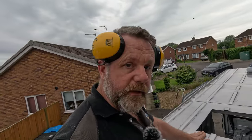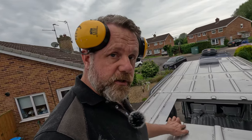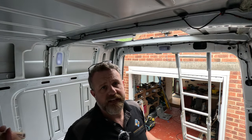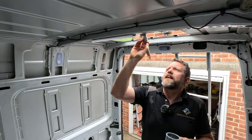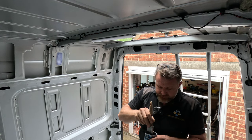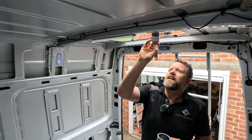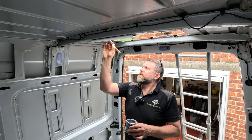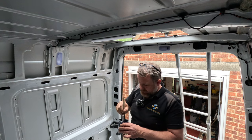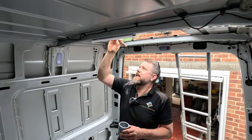Now I've got to do the painstaking job of filing it, quickly get some paint on it, then clean it up and start building it up so the skylight can sit on top — because we've got these ridges I have to build up with mastic tape. I've filed all around it and now I'm going to get a bit of Hammerite around there to seal up those edges. As that dries I'll be putting mastic tape on the roof to fill up the gaps between the ridges, then some Sikaflex, and then basically dropping the skylight in and either clamping it or screwing it. I'll also Sikaflex the wooden frame underneath, and hopefully that will just clamp to the skylight. Can you tell I'm winging it?